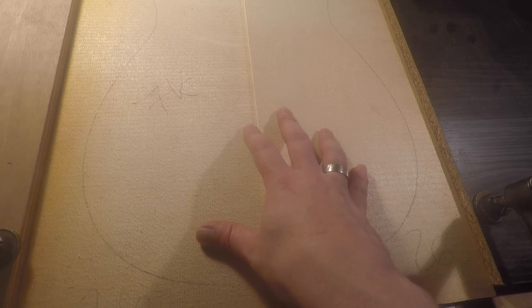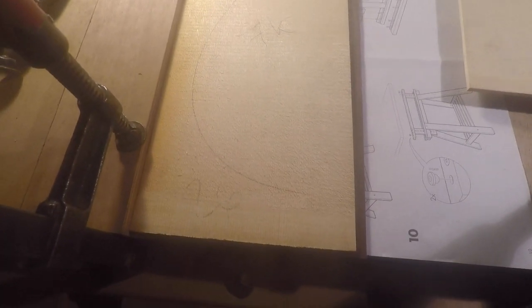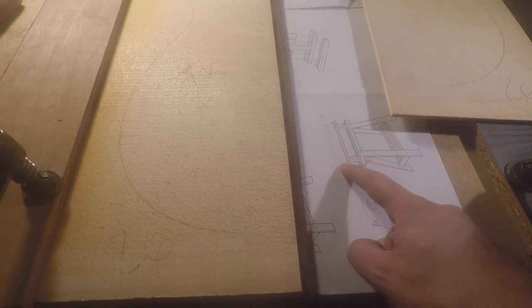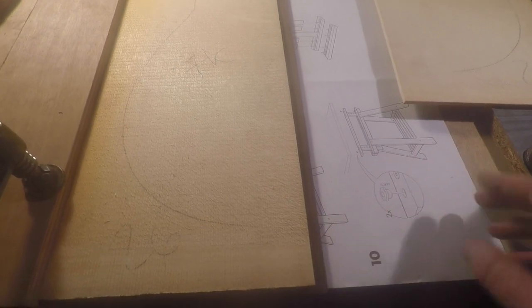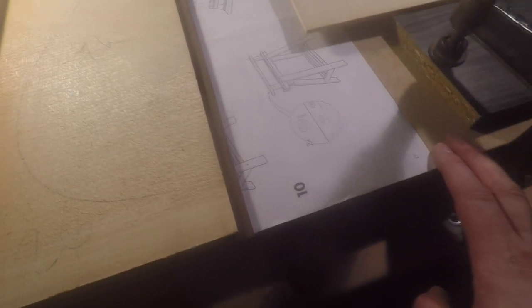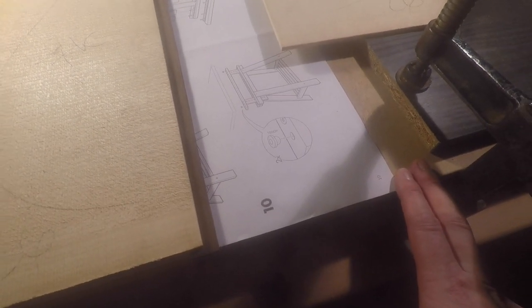When gluing both sides together we need some pressure on the sides, in this direction and the other direction also, so both sides stick together very well. What I use for it, there are other different options as well, but I'm going to try this one now. In the middle we put some paper, because when gluing, the glue comes out of the joint, and if we don't use some paper our top plate will stick to the base plate. We don't want that, of course.